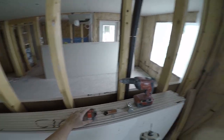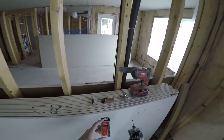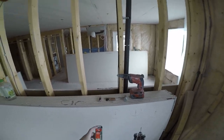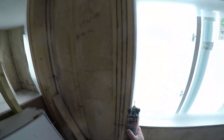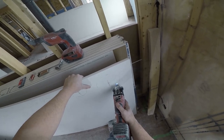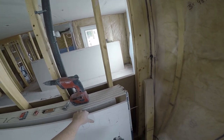So this is the 3mm, that 1/8 standard bit. Okay, I love these bits because they're really nice for cutting cutouts like this. I can do boxes and doorways and all kinds of stuff with them. Well, I'm going to cut this and I'm going to switch over to the quarter inch bit for the window. I'm going to route her on a slight angle backwards, okay? Away from the line.